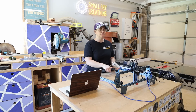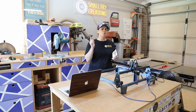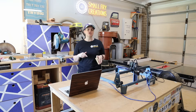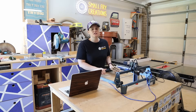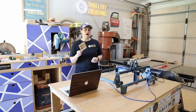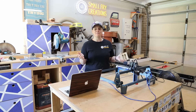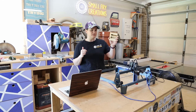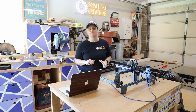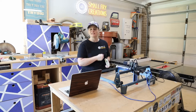Within a day you can 100% go from having a laser in a box to being set up and engraving on material, which is really cool. But I want to take it one step further and see how this machine cuts. The Sculpfun S9 is designed to cut up to 15 millimeters thick material, so I'm going to adjust my logo to cut it out and test it on some 15mm basswood as well as some 3mm plywood. Let's jump back into LightBurn, get those settings dialed in, and let's get cutting.